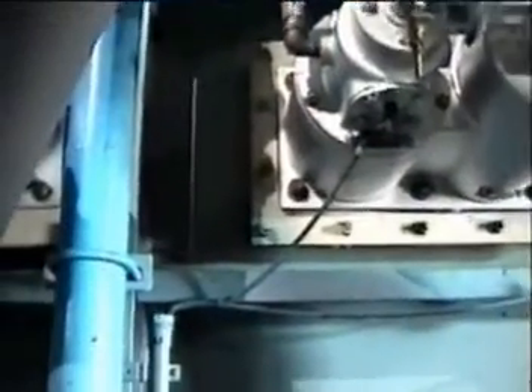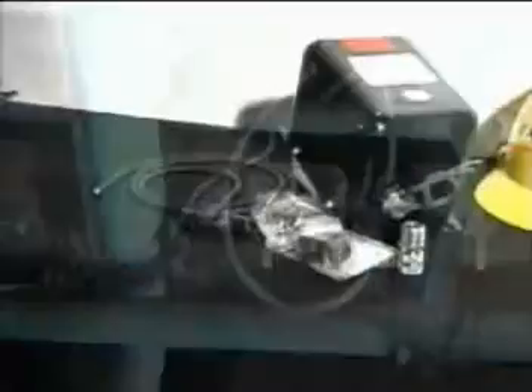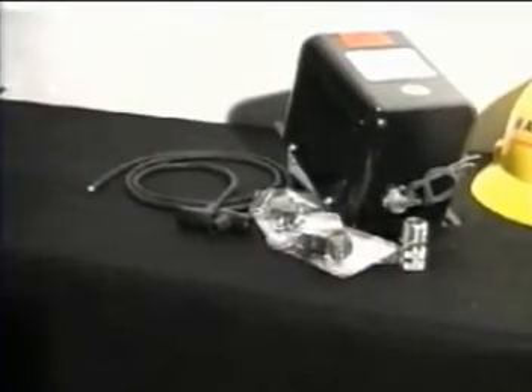The Unirad is best operated on-off. The problem with firing on-off in a heat treat furnace is getting reliable ignition week after week, month after month, year after year. The Unirad is unique in that we are able to operate on-off because of our very reliable sparking system.